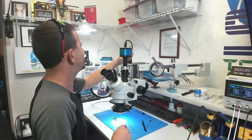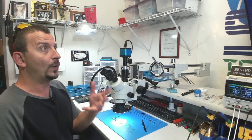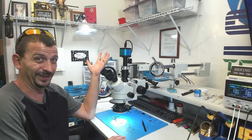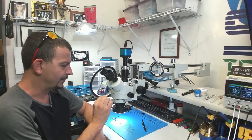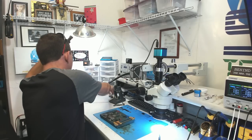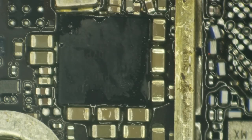This is absolutely, positively quite a bit of carnage. What I'm going to do is dig in — I'm basically going to wipe this area of the board clean. Some of the components I'll try to nudge back into place, but for the most part I'm going to be wiping a lot of this clean and seeing what, at minimum, I need to get this to boot. I'm going to switch to my smallest nozzle and start at 375 degrees C with an airflow of 40.